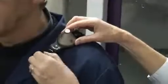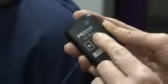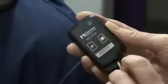The dose badge can then be removed and is ready for the measurements to be downloaded. The dose badge may also be started and stopped using the RC101 key fob remote control unit. Point the key fob at the dose badge infrared window and press the run or stop button. The dose badge will function in exactly the same way as from the reader unit.